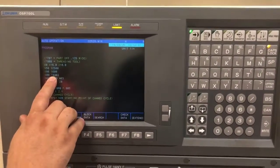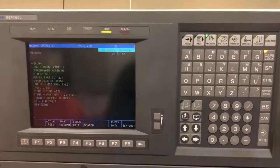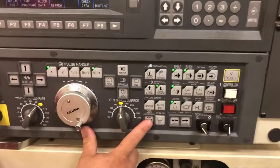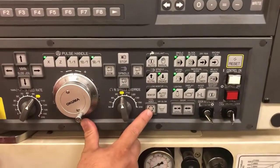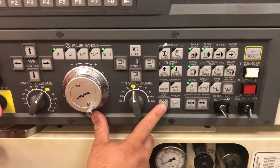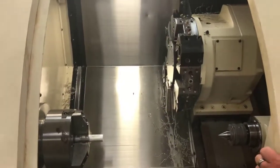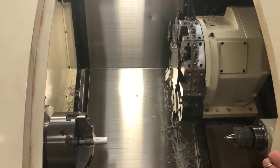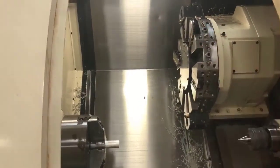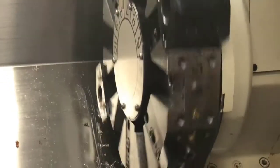I'm going to call up tool number 3. On this machine, I'll go into manual mode and come down to my tool index. On this machine you can only index one direction — I can push and hold the tool index button for continuous motion or push it once to change. With the door open I can only do one at a time. The insert I'm actually using is going to be a DNMG, which is fine for what we're doing. I'm going to pull that tool up to the active tool.